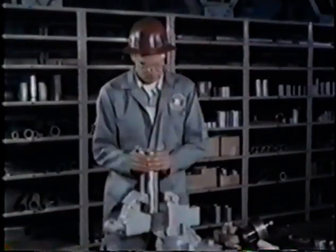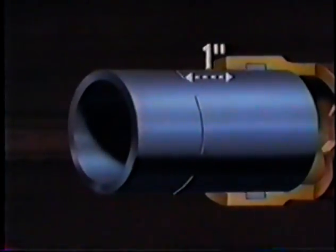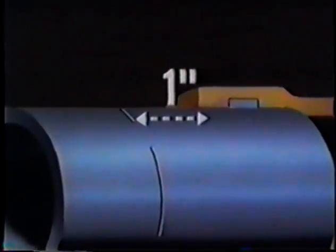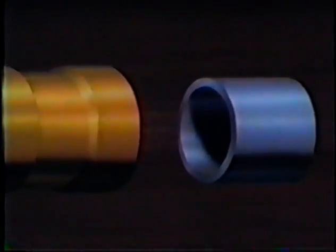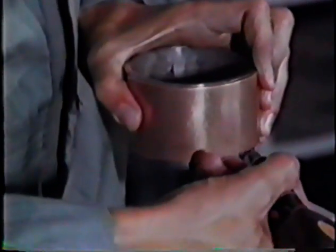You need to establish reference marks to make sure the pipe is seated properly in the fitting before and after brazing. Measure socket depth and add 1 inch. Lightly scribe the resulting distance or reference marks around the pipe at 3 locations. If the pipe is all the way in and bottomed, the distance will measure 1 inch from reference marks to fitting face. Sometimes, as in this case, you have less than 1 inch of exposed pipe. In such cases, choose a clearance distance that will leave the scribe marks visible after brazing. These reference marks are also used after brazing to check the finished joint.